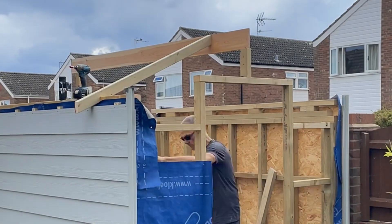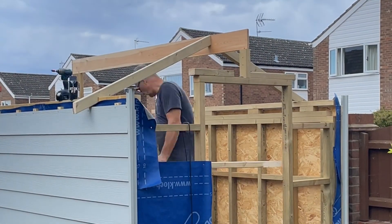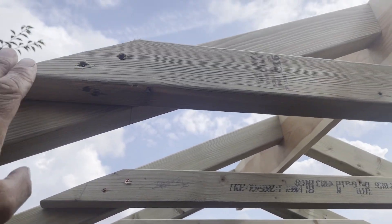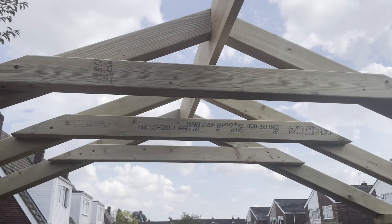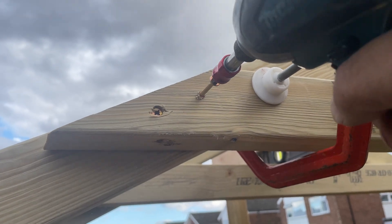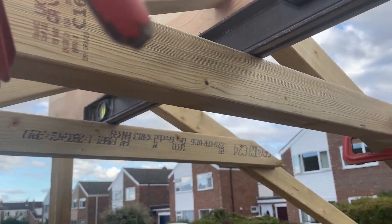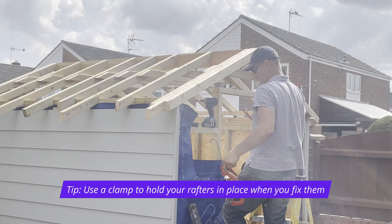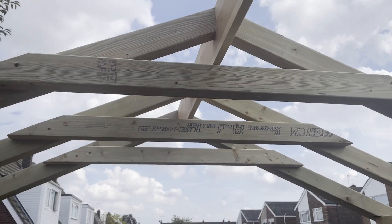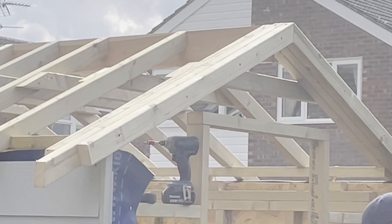Because I didn't have the walls built, I had to put these little uprights of timber to hold the ridge board up — a little piece at each end. Once I'd got the ridge board on, I could then add the rafters to it, and I've added the flat ceiling joists which will tie the rafters together. I've kept them high to give me a little bit of extra height inside the observatory. The pitch of the roof is quite low — only 22.5 degrees — because I didn't want the roof to be any steeper and interfere with the view of the scope. The rafter length is 1.3 meters long, the flat ceiling timbers were about 1.1 meters, and I doubled up the rafters on the ends.